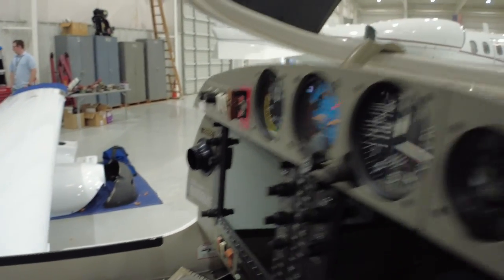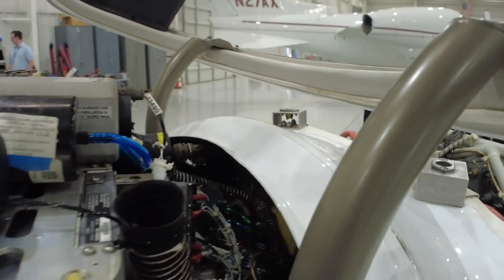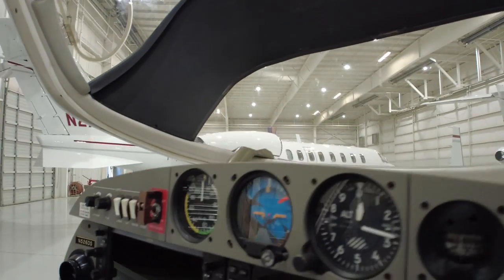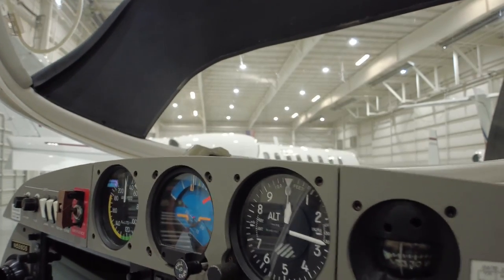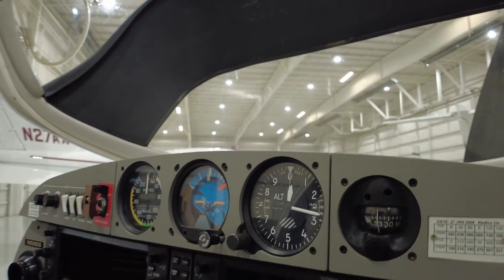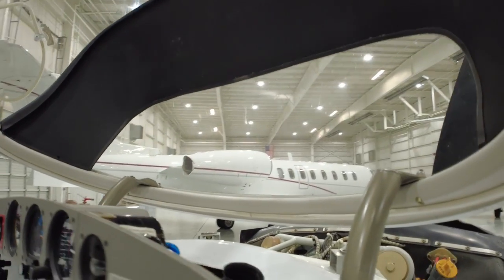We're going to see what that looks like — it shouldn't be too bad. We've got a little electrical work, a little plumbing, a tee off of these lines to put it in, and we have to replace a circuit breaker right here. It does make these two dials redundant; we really don't need the airspeed indicator or the altimeter here because it'll all be built into the center unit. However, instead of looking at two blank plates, I'll probably just leave them in. Let's get started on that.